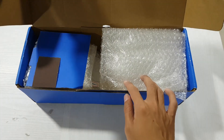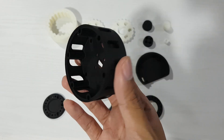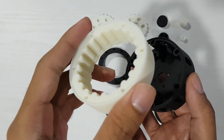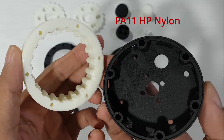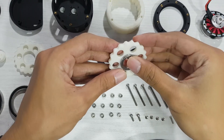The results honestly raised my standards for what good 3D printing should look like. I don't think I need to worry anymore about weird part geometries that usually come out imperfect because of supports. I tested two materials: JLC Temp Resin and PA 11HP Nylon. By adding a gap of 0.05 millimeters in the design, the parts fit perfectly with the bearings.